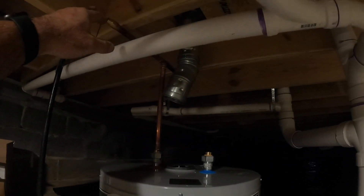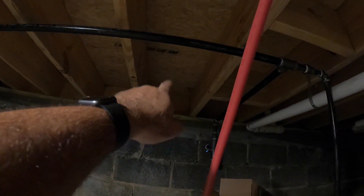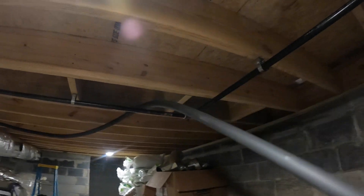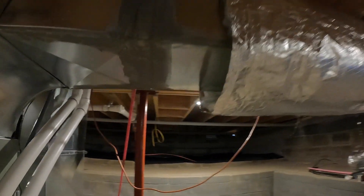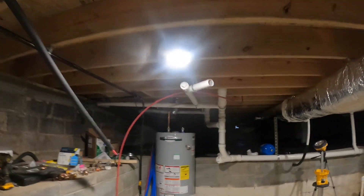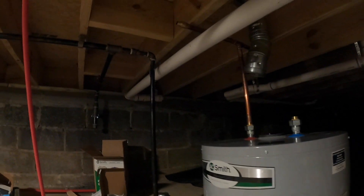On this side, what we're probably going to do is immediately come off of here and catch this guy coming around to the washing machine. That hole there goes up to the washing machine. And that's a sink cold, so this will be hot. We'll have another one here coming over and teeing in. Straight back there we have our vanity - it'll come back and tee in. Right here we have a bathtub, so it'll tee in. And coming off the very end is a long one that goes around to the kitchen sink - just half inch. The cold's a little more complex because it goes more places like toilets and the supply. You've got an expansion tank that's got to go into it, pressure reducer, stuff like that.